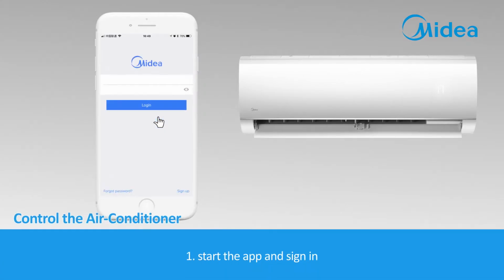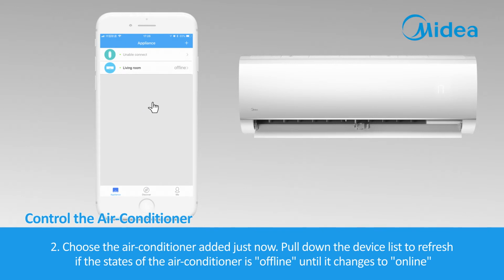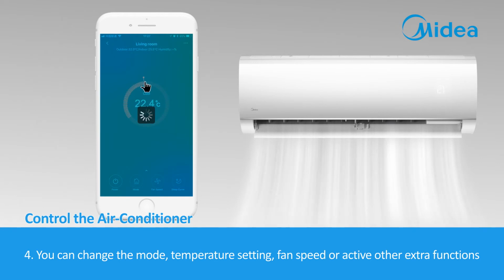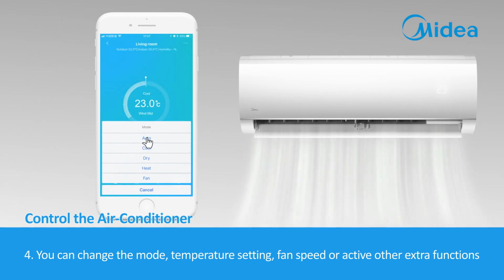Control the air conditioner. 1. Start the app and sign in. 2. Choose the air conditioner added just now. Pull down the device list to refresh if the state of the air conditioner is offline until it changes to online. 3. Then you can go into the operation interface. Turn on the air conditioner first. 4. You can change the mode, temperature setting, fan speed, or activate other extra functions.